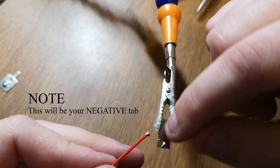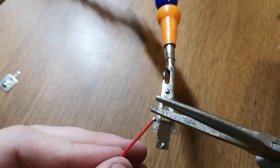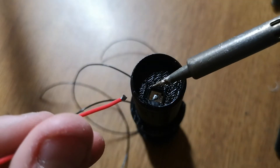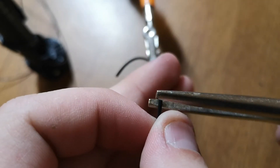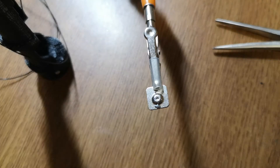To solder our wire on, we're going to go to the back of the pad. I strip the wire and pinch the tip with my pliers a little bit to flatten it out — I don't want it bulging out or it's not going to fit in its slots. Since we're doing NeoPixel and the slot for the battery is quite small, we're actually going to insert it and then wire it through from the top to solder it in. This may be a little tricky, so be careful and patient not to melt the chassis. We're going to crush the tip of the wire with our pliers a little bit, flatten it out, then tin it and solder it.